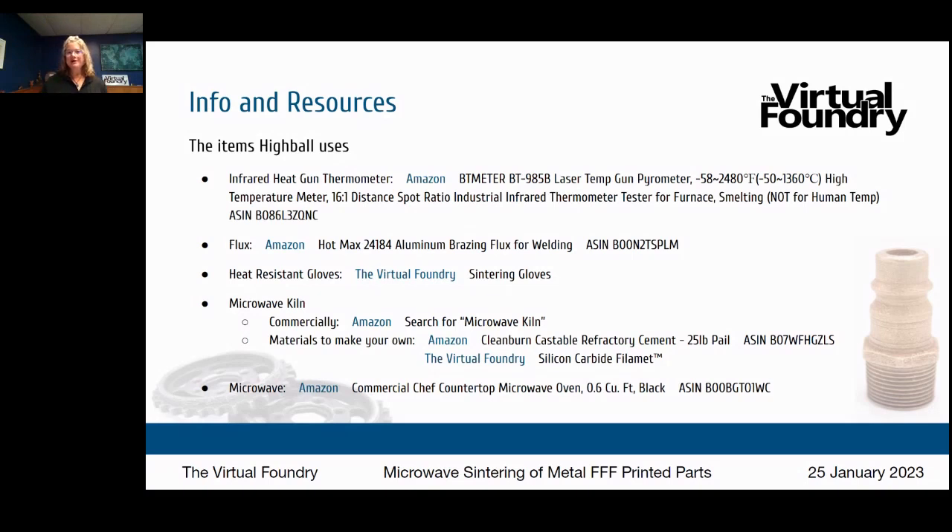We have resources on our YouTube channel to help you understand which slicer parameters to pay attention to. The most basic ones are a print temperature of 210°C, which you can adjust up or down, and an exaggerated flow rate of 135%. The filament is standard diameter, but it takes more energy to push through the nozzle — rather than melted plastic pushing through, it's more like bread dough — so we exaggerate the flow rate to 135% so the 3D printer applies more energy to push it through.